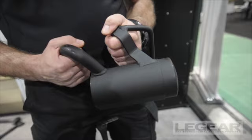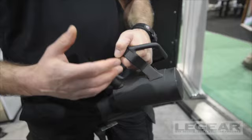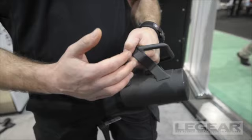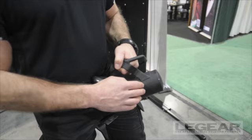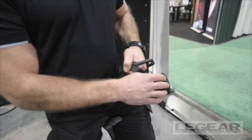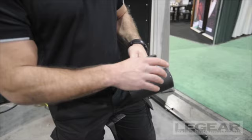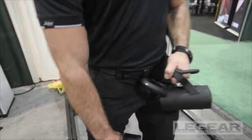You don't have to swing backwards and interfere with the team standing behind you. Most importantly, we looked at the carpenters again — you will never see a hammer with a flat hitting surface because a flat surface will bend the nail. The same goes for this ram: a flat hitting surface, as on a traditional ram, will steer the tool in a direction you don't want. You will always get an unclean hit, which creates a shock that travels through the prying bar and into your hands and causes nerve damage.